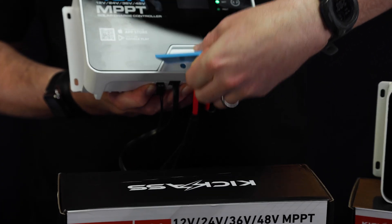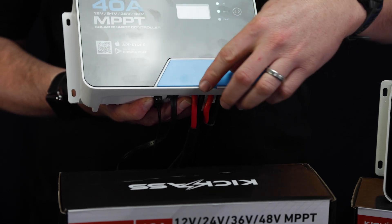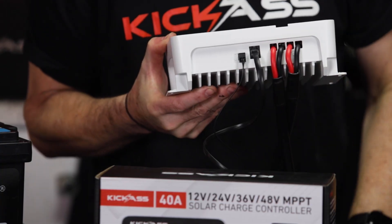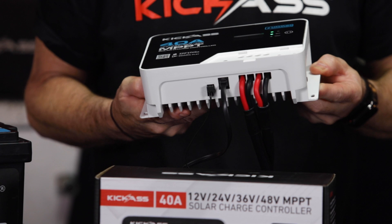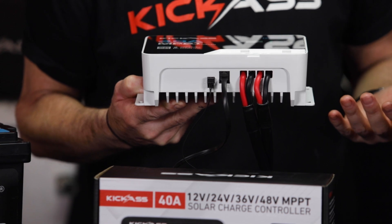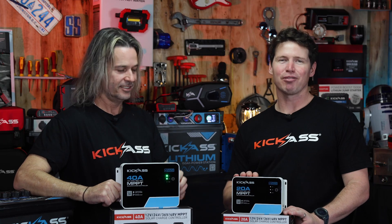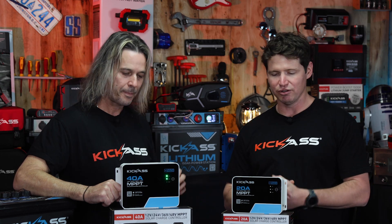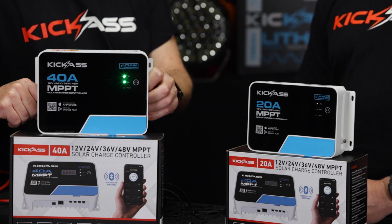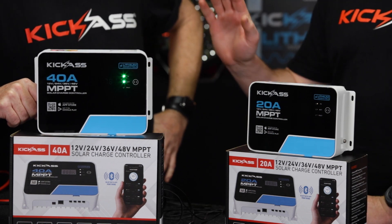As far as setting up, you really need no technical knowledge whatsoever — these are pretty simple. There's a nice little cover with a magnet on it so you don't lose it. With just a couple of wires it's easy to install: you've got your temp sensor, the data port to connect to the remote display or for parallel charge setup with another charger, and your solar and battery positive and negative. This is a great product for a dual battery installation without the full alternator wiring kit — fantastic for a canopy, van life, or the 20-amp MPPT. For larger off-grid installations like a shed or shack, the 40-amp or a parallel combination, or a large caravan with plenty of roof solar, this is a great product as well.